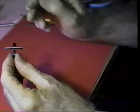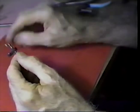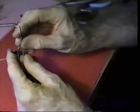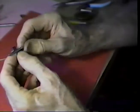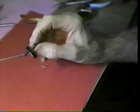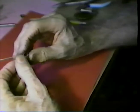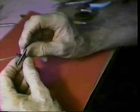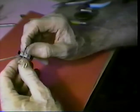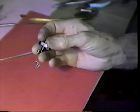And that's the reason that I just treat these right out on the tip. All right, I'm going off the camera again, and I'm going to wire brush this with a little rotary wire brush. I'll spend about 60 seconds. I've got a little wheel about 2.5 inches in diameter with soft steel wire bristles, and it's in a lathe over here to my left. I'll wire brush this a little, and then we'll take a look and see what that does for it.